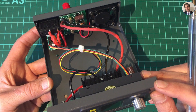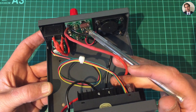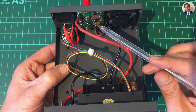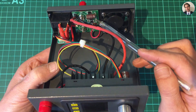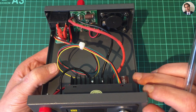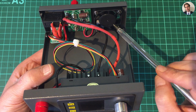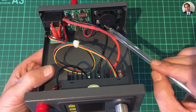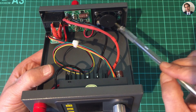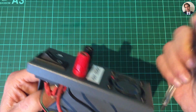It's all built now. Before I close this up, a quick run-through of what you're seeing here. First, this PCB - that is where the banana jacks are mounted straight on to the PCB. Then there is a chip which is an XL7005A, which is a DC to DC buck converter, and that drives this fan. This fan is always on. There are some modifications you can make so the fan only turns on above a certain current or temperature, but in my case it's just fine with the fan always running.